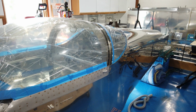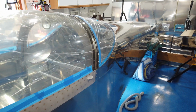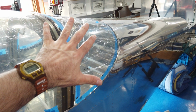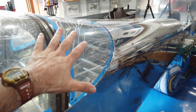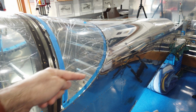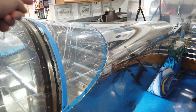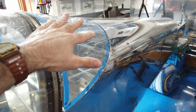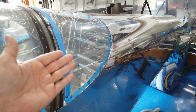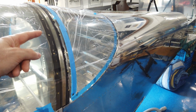Howdy, everyone. All right, the rear window is now permanently installed on the airplane. Like I had said before, I was able to basically manipulate the window around and get fuel tank sealant up underneath this side area and along the back, on both sides and along the back. Got it into place, and then I was able to have this front area here up so I can get fuel tank sealant underneath it all the way around this front edge.